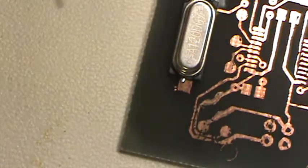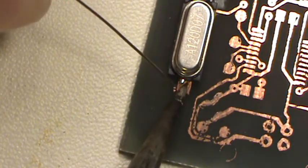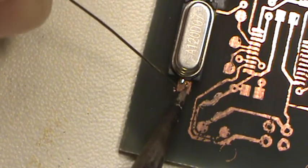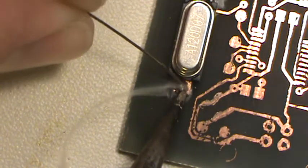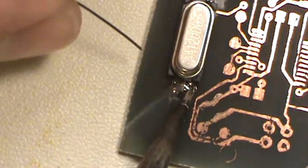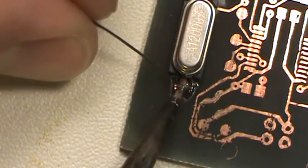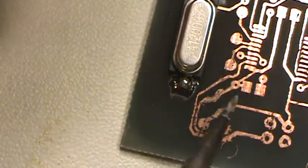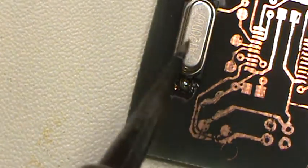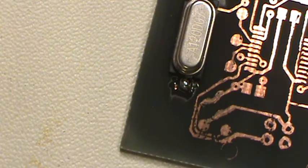Okay, so now I'm going to turn it around, I'm right-handed, so I like to do everything from the right side. And grab our solder. And then all you do is just set the tip on here. Now, a lot of people think the harder you push, the more heat you're going to get into it, which is more or less false. You don't have to shove really, really hard. A lot of times, if you shove really hard, you could end up bending your tip, or worse, damaging your circuit board that you paid maybe tens of dollars for, or maybe hundreds of dollars for.